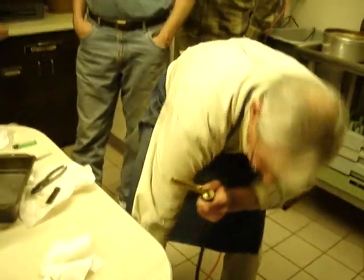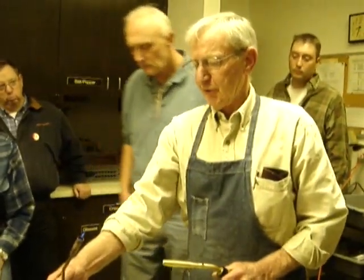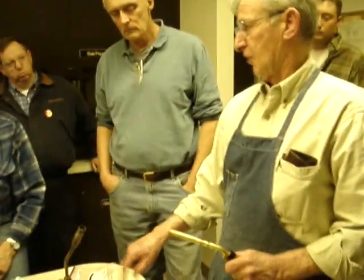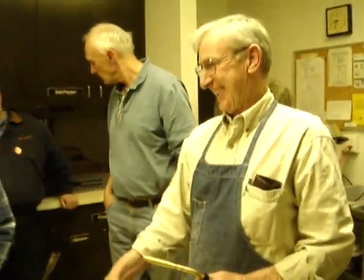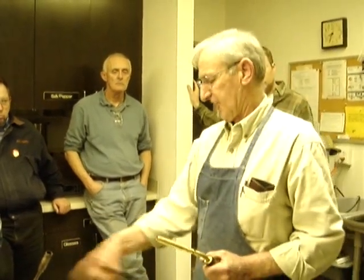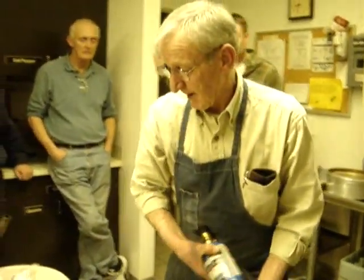If you get into doing this hot and heavy some weekend, and you find that you're having trouble achieving the hardness that you want, it could be that your quench medium is getting too warm. Like if you make yourself 20 knives in one day, the oil is going to get pretty darn warm. You need an instantaneous cooling, and it could be that it's warmed up to the point where you're just not getting a proper quench. In a commercial heat treat facility, that's always circulated and cooled. Throw some ice cubes in there? I don't think you want to do that in your oil.